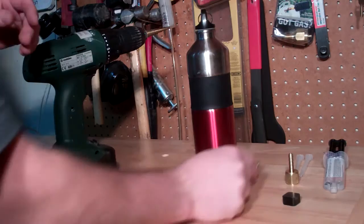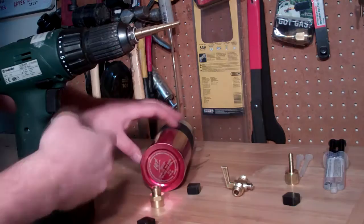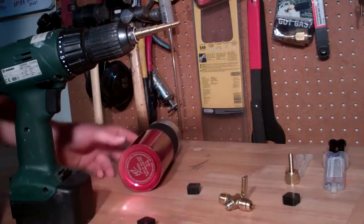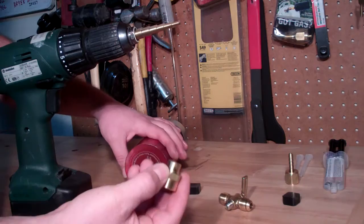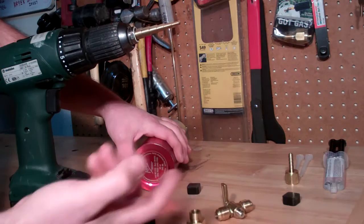Depending on the type of fitting and how you're going to attach your valve to the bottom of the canister will determine how big a hole you need to drill. I'm going to use a step drill because this material is real thin and it'll be real easy. I'm using a fitting that will screw on to my shut-off valve. This is actually a reducer — I chose this style because it has a lot of surface area, so we can run our epoxy and it'll make a good tight bond. You could just thread a fitting in and epoxy it, but that might not be as durable.